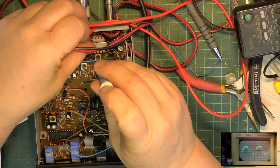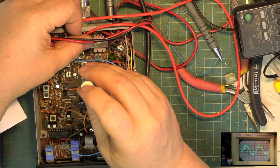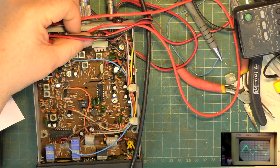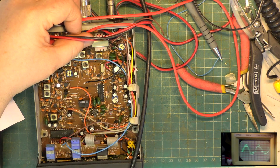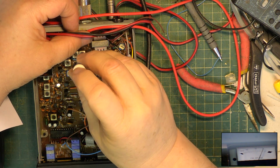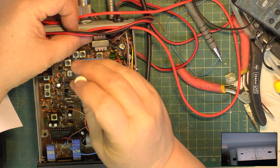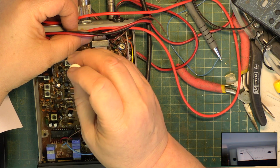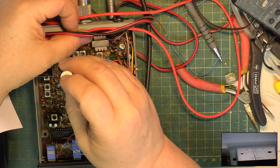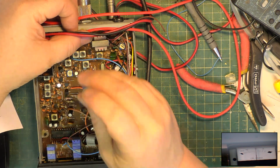Crystal filtered, which was a requirement with PR2794. And I suspect the rest of the front end. So we'll drop that now down to, I'm not even showing you the SINAD meter. Drop it down to about 6 dB. Back off the attenuator. Back it off again. I think that's where we are with it.